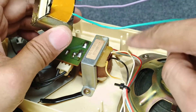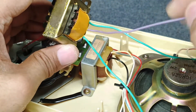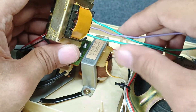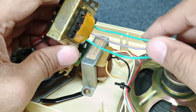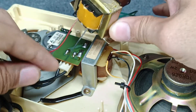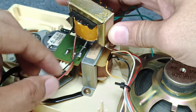The green or this white, you can interchange this one. Never interchange the center tap — this part here. The center tap must be on the block, and we are dealing here with AC volts, so no need for polarity. This part here is also AC, so you can tap either this part or this part here, or you can swap this one and the red on this side.